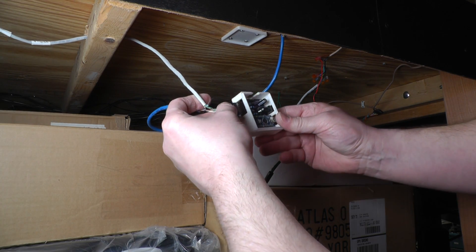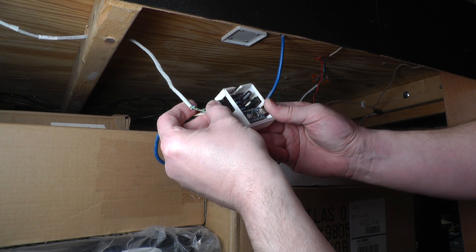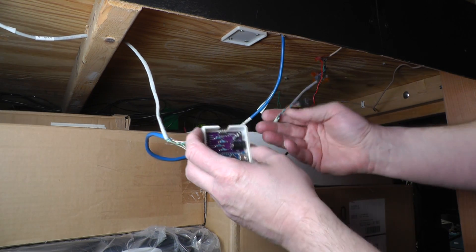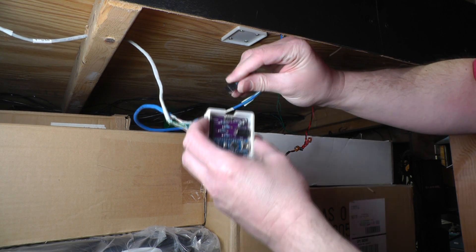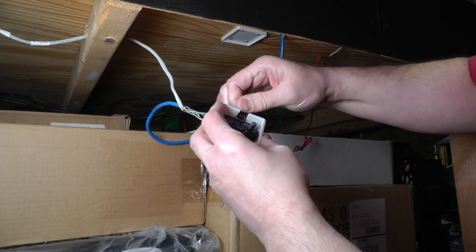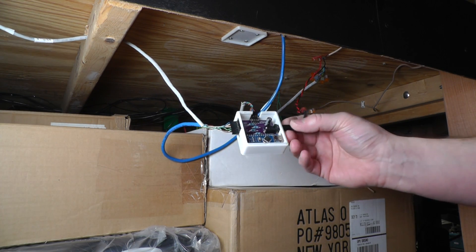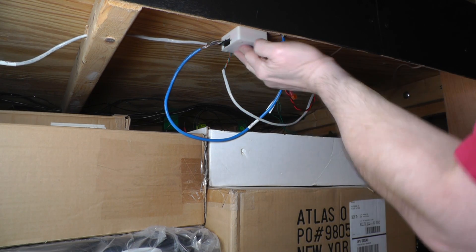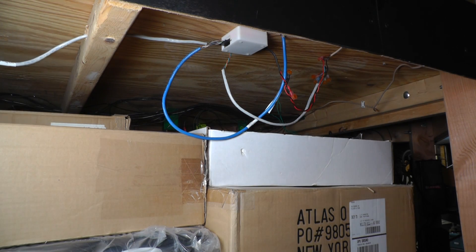What makes the Revision 2 circuit board design so much nicer are these DuPont connector headers. Once I made them, I can just plug in the sensors all at once instead of having to do 8 or 12 individual screw terminals. Here's the connector for the display, which is up on the top of the layout — just plug that in, done. And my 5 volt DC power. Now the way I designed this enclosure, it'll just snap into the top, which is screw-mounted up under the layout, and there we go. I can tie up these wires later with some wire ties or connectors.